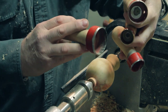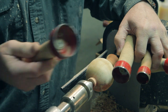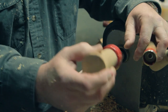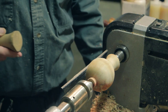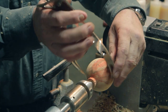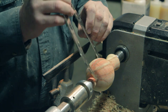I'm not sure who invented these, but I'm the first one I know of who has actually made them. These are tools to help round the surface — they started life as hole saws. Grind the teeth off, fasten to a handle, and what you have is a tool that will scrape a circular arc across the surface. What it does is not just show you where the high spot is — it'll actually cut off the high spot. Since the calipers are still set to the original diameter, you can use them to evaluate how close to round your figure actually is. This one is just a little bit long on the ends, but we're getting pretty close to a spherical shape.